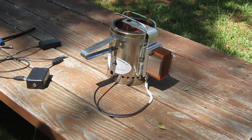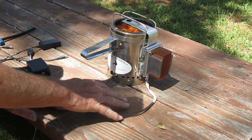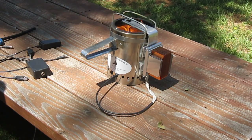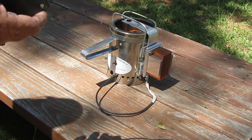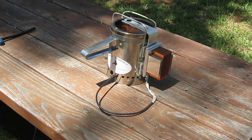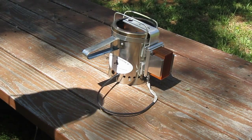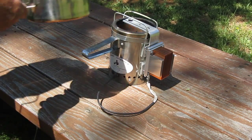What I found out was you didn't need the battery at all. I'm running the wood gas stove directly off the thermoelectric generator, which is pretty cool. It could take 8–10 hours to charge the 5 volt battery, so the fact that it runs off its own power is great. The wood gasification process has started already — it's injecting the hot air into the fumes and igniting them.